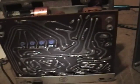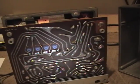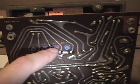There's a small rectifier — some of these have selenium rectifiers, but that looks like a silicon diode. There's a filter cap; I'll replace that, just 10 microfarad, no big deal. And this actually uses a circuit board — a very early type of circuit board. There are the calibration pots.